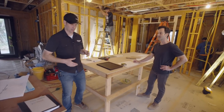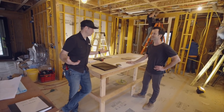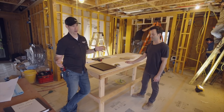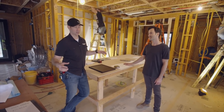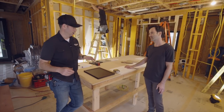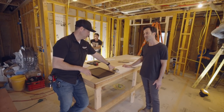If you're building a kitchen with a 30-inch slide-in range — LG, Samsung, Whirlpool — those are pretty much the same. However, if you're doing other models like a drop-in cooktop, gas or electric, 30 or 36 inch, there are so many options and changes. You've got to decide that early and give it to your cabinet guy so the shop drawings come out correct. I couldn't even hold off on the decision — there are many manufacturers of built-in 30-inch refrigerators like Sub-Zero, but I decided on Miele. The 30-inch Miele and 18-inch Miele freezer have such specific requirements for the overlay doors, electrical, and plumbing. You've got to choose that early.